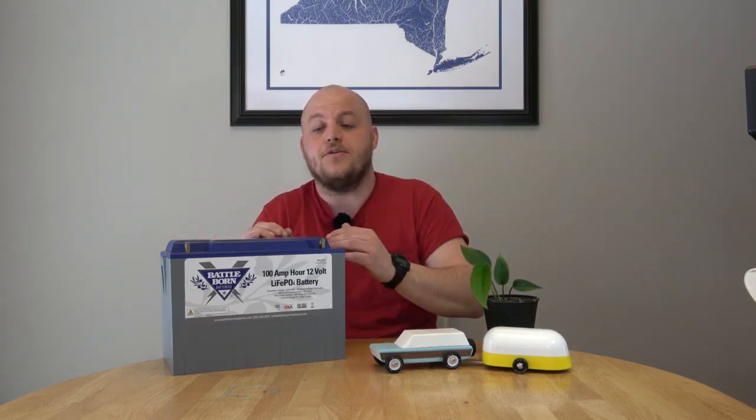It's important to separate the RV batteries from the cabin batteries. There are some low-cost, high build quality batteries without temperature sensors — we can compensate for that in an off-grid cabin with high quality charge controllers. But since your camper gets charged by your tow vehicle, solar, and shore power, it is far more difficult to do that. So we have to start with a battery that has reliable temperature sensors, and once again these are the batteries that still cost a lot of money.